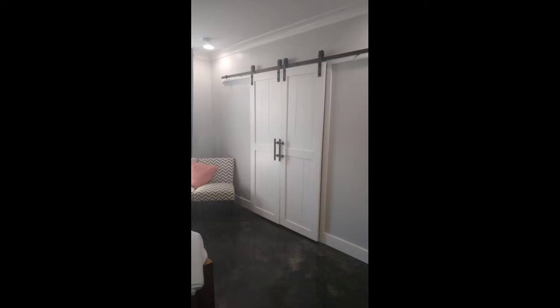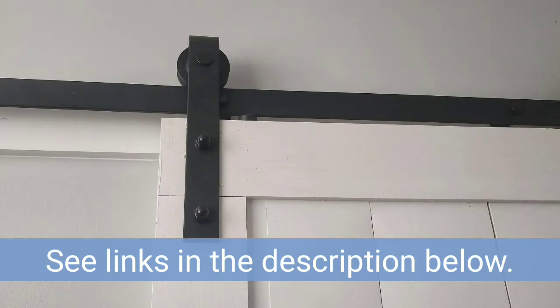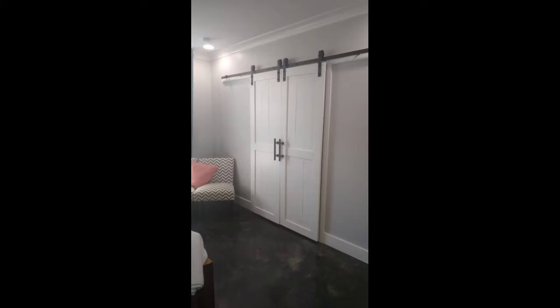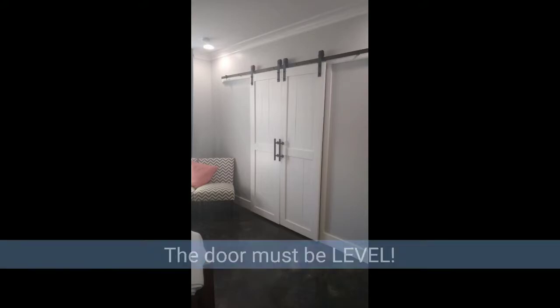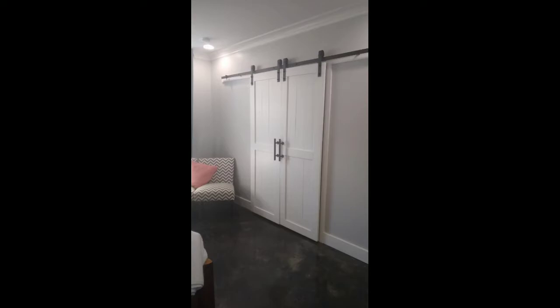What you're seeing here is a portrait view of the same two doors so you can take in the height of them. The hardware I used for the doors is available on Amazon — I've put links to both the handles and the sliding rails in the description. The biggest point is that when you're hanging the door and installing these rails, you want to make sure you're drilling into studs or using drywall anchors so those rails stay in place. You also want to make sure the door is level, because if it's not level it's going to close on its own, be very difficult to close, or even come open on its own.